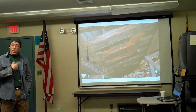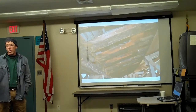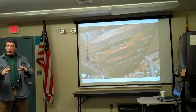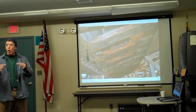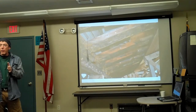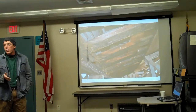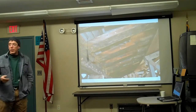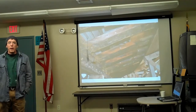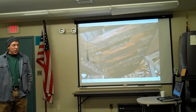Long Island is great because we have black locusts and honey locusts here — particularly black locusts — and those trees don't grow straight at all. One of the beauties of locust is that the yield in the timber is almost the size of the log: the bark is very thin, the sapwood layer is very thin. So if you see a 10-inch tree, you're going to get 8.5 inches of good usable lumber, and it's guaranteed to be curved. It's the same process as 130 years ago — back then they probably didn't have to go more than half a mile to find all the lumber. Today you have to go miles and miles, or have connections with guys who do tree work.